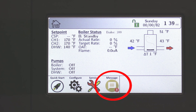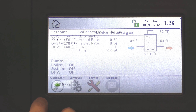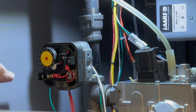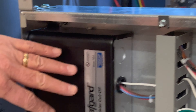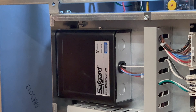We do have a message box that appeared. If we click on that message box — in this example a warning for low gas pressure switch — you can go to service, digital I/O, and you'd be able to see if you have multiple. I've taken the cover off the low gas pressure switch and I'm going to reset it. You'll see all safeties are clear. In a brand new startup, you might have a low water cutoff installed that may be tripped, so reset your low water cutoff — right down here is our low water cutoff, under a cover plate I've removed for the video.